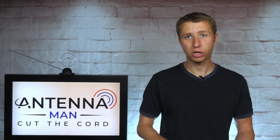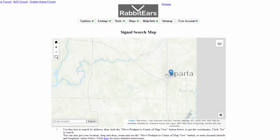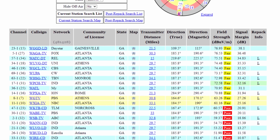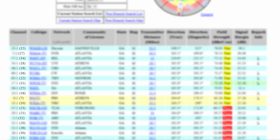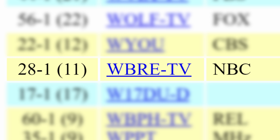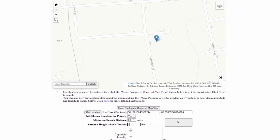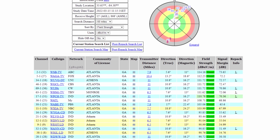You can find the RF channels of the TV stations in your area by running a reception report on rabbitears.info under signal search and looking at the RF channel in parentheses. Most times it's not the channel number you're used to seeing on your TV set or even used on air by the TV station. WBRE, which displays as channel 28 on most TV sets, actually broadcasts on RF channel 11, which is a channel number I needed to use to manually add it. Additional instructions on how to run a reception report to locate the RF channels of TV stations in your area can be found in a video attached in the description of this video.